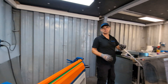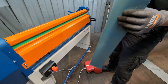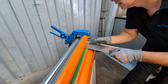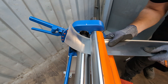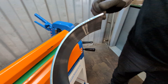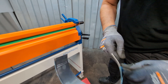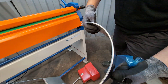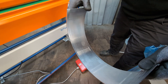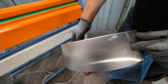Next I'll show hemming. I have a metal strip with an edge of five millimeters and I want to round it so the edge comes to the inside. Here is the result — we call it hemming. You can see it's rounded. It's harder with really small radii, but from a bigger radius it's no problem. This is also possible with steel and stainless steel.